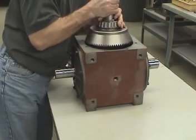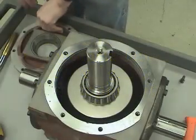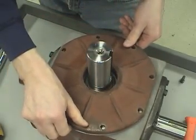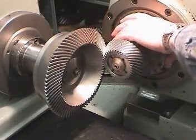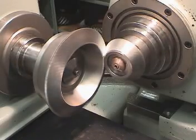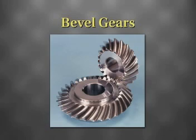In this section, we'll be talking about the specific reasons why proper installation of bevel gears is so important. Installing bevel gears is much more involved than installing spur gears. For example, bevel gears must be oriented to each other so that they run smoothly without binding or interference. They must also maintain the correct amount of tooth clearance at all operating conditions. For spur and helical gears, the best orientation normally requires only that the center distance and shaft alignment be correct. No further adjustment is needed. This is seldom the case with bevel gears because the mounting arrangements allow for wide variations in position.